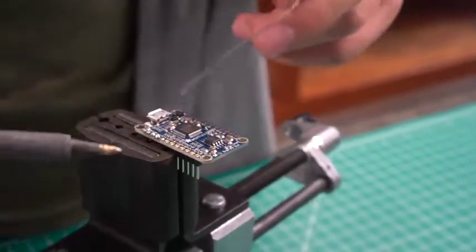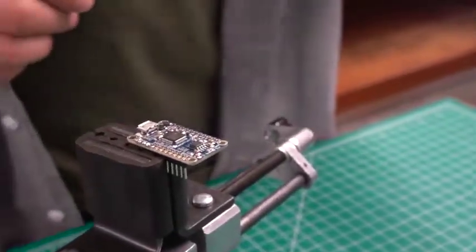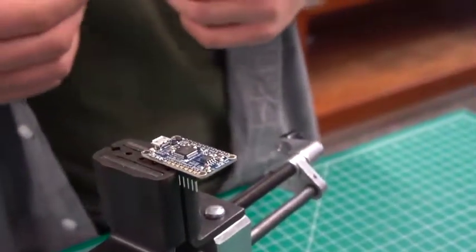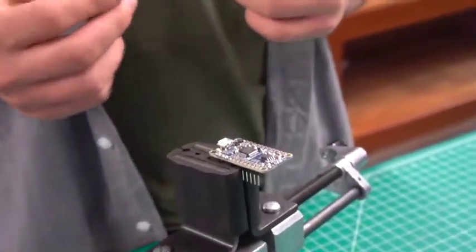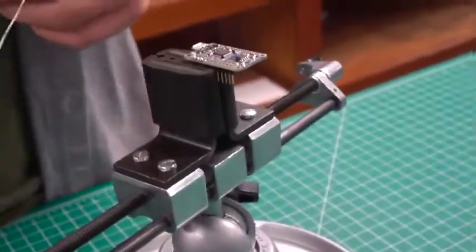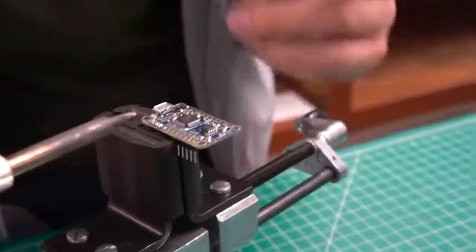What happens if you connect them accidentally? So the question is, what happens if you connect two pins together? It is basically going to close a circuit between two pins — it is looking for a connection between a voltage and a ground, like a button. If you have the two pins connected, then closing the circuit on one will close the circuit on the other and it will trigger both. So you won't be able to distinguish between the two in the way you have this thing set up.